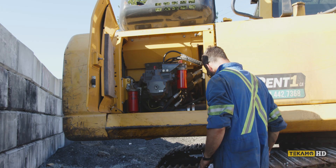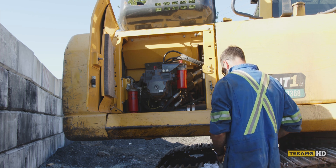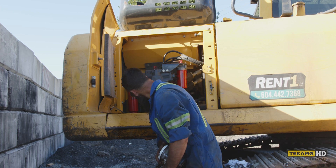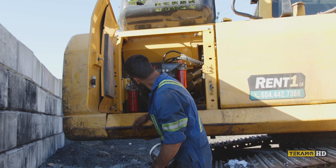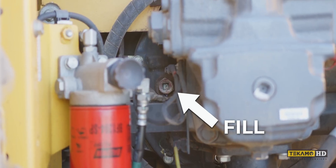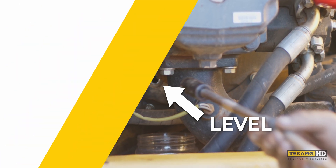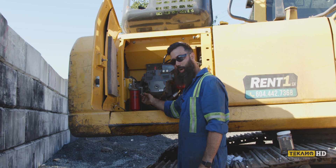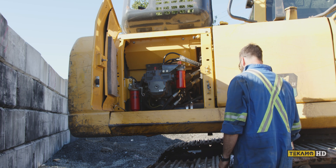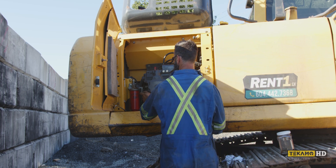I got that tight. Now I'm going to rig up a nice long extension to reach another plug back here — that's where I'm going to fill it from, and when oil leaks out this hole I'll know it's full. I'm just using the square end of an extension to go inside the plug, then using my half-inch flex bar to break it loose.